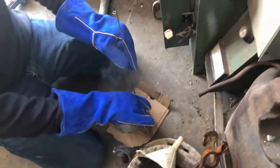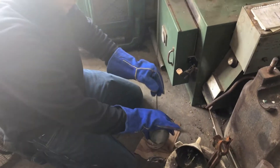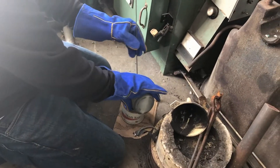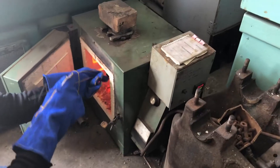Realistically, we'll probably get just a little bit of outside layer hardened to maybe 55 Rockwell. For this application — antique equipment that's going to run very sporadically — it'll outlast me. Back in it goes; let it soak again to get up to temperature, then we'll probably hit it another two more times.